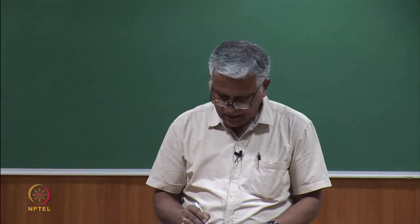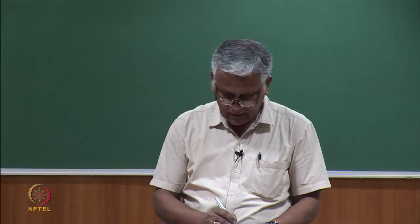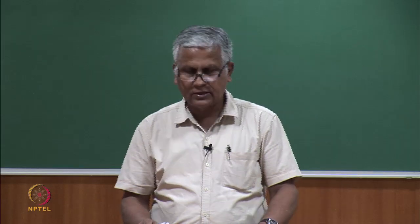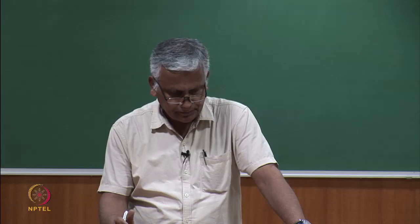For synthetic fibers, the critical draft value is slightly more than cotton. So this is what we have to keep in mind, and why we are always very much concerned with the selection of break draft on ring spinning.